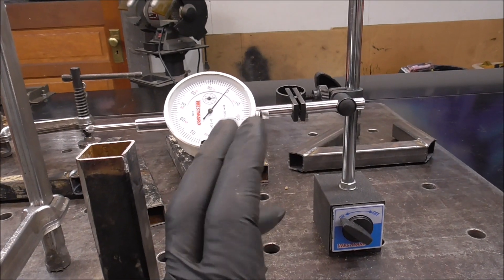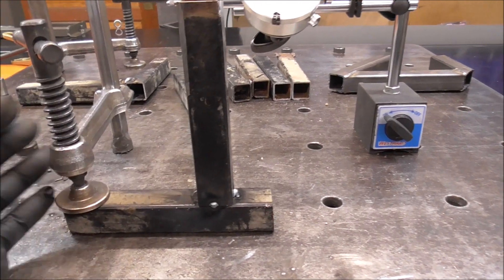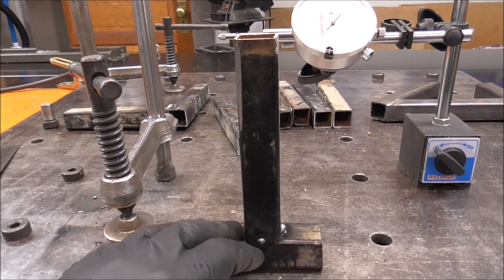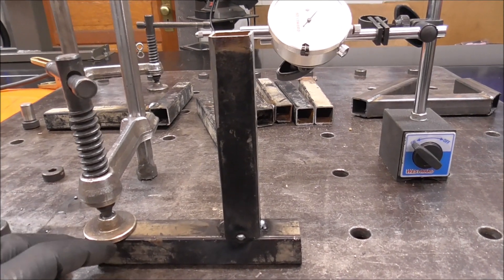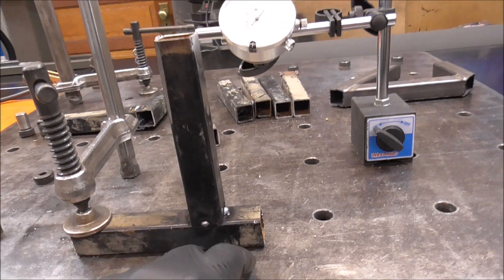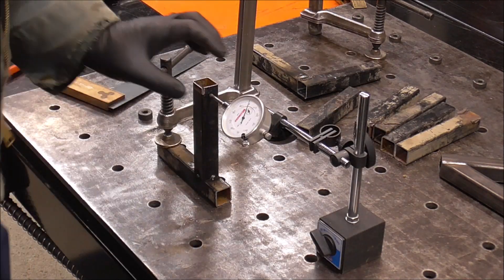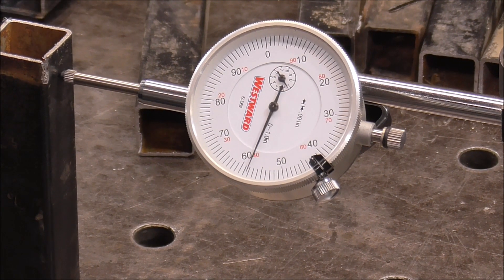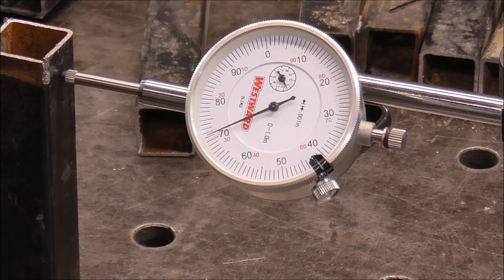You're just trying to create equal forces in the part. Now that I've got it tacked on all four corners, if the square shows it looks perfect, we can pick whichever side we want - we just have to make sure we put an even amount of heat input. It'll rarely be perfect, but that's why I chose this dial indicator. These are measured in thousandths of an inch - a piece of paper is four thousandths thick. For workshop projects, you probably don't need to get within a thousandth of an inch, but this helps you understand the forces. Now I'll weld one side and we'll watch the gauge - it climbed to about sixty-five thousandths.